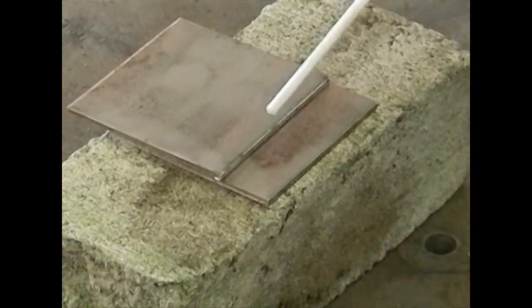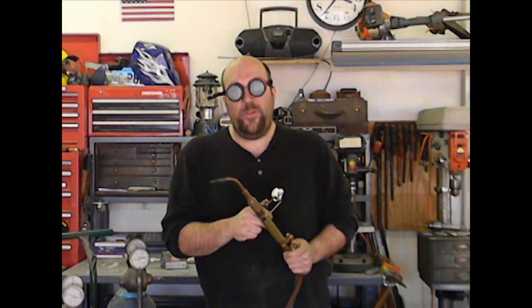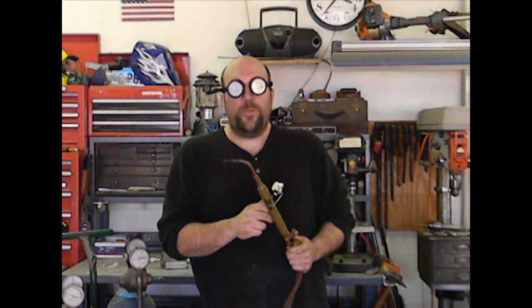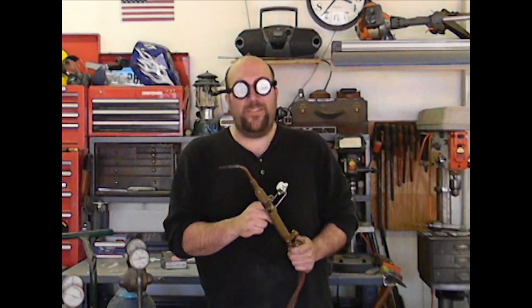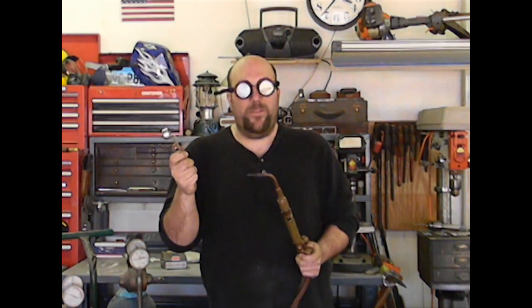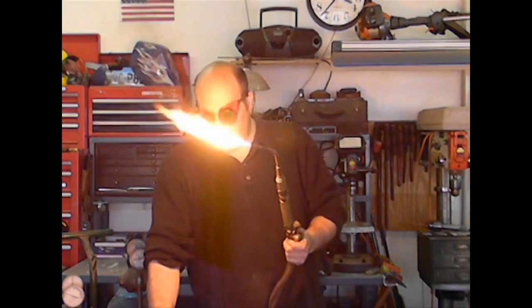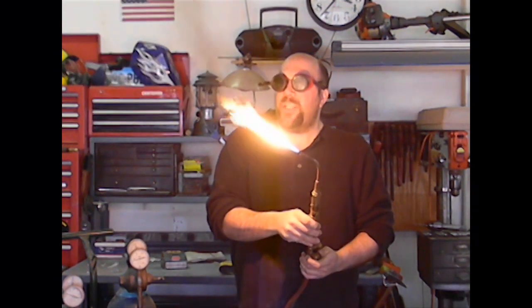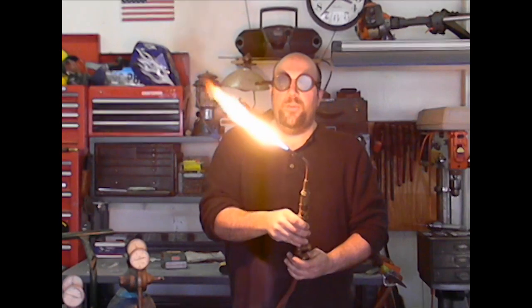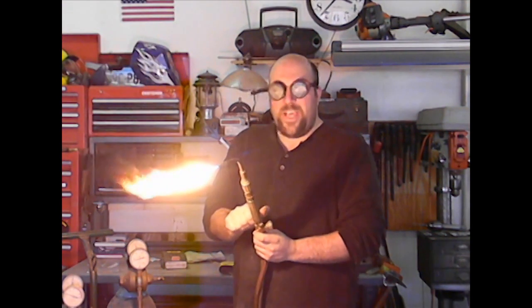I'm going to be making a very simple lap joint. I'm going to tack the end of my plate and start at the opposite end and lay a bead of weld. Now I know there are people out there who will light a torch with their cigarette lighter — it is absolutely not the safe thing to do. These strikers cost less than two bucks and it's the right way to do it. Crack your acetylene until you hear the gas start flowing and simply squeeze the striker in front of the tip. There's a black smoke that comes off the acetylene when you first light it — turn out your acetylene until that black smoke disappears, then start adding your oxygen.